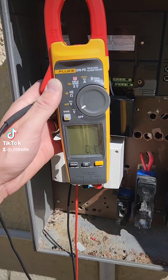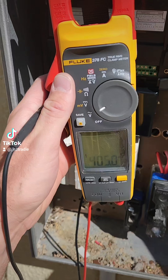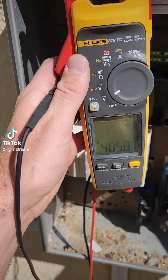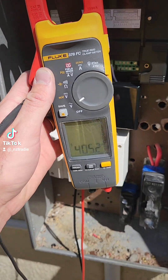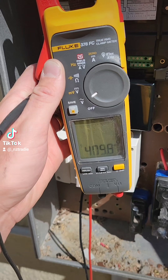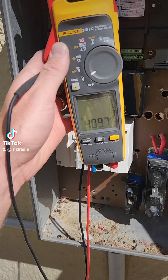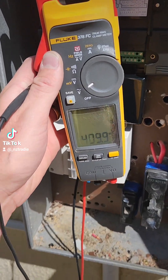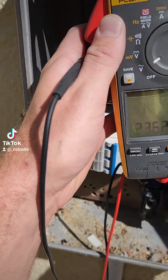Put that on the third phase — the third one on the Q relay. Okay, zero volts, and if I go here we've got 400, here we've got 400. Go to the second phase. Are you on the second phase? Yep. There we go — second phase is actually the third phase inside.